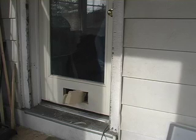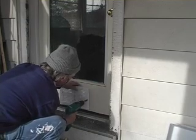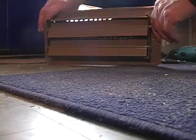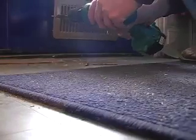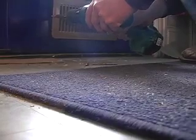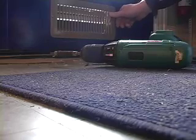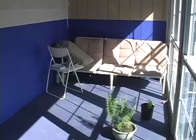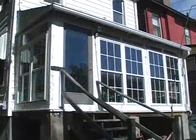That's a metal door with a styrofoam inlay. I'm putting a grill over it to make it look nice. So when the hot air is pulled out it's pulling air from the house — that's a vent that opens and closes. I open it on hot days but you could use one that just has a flap so you don't have to worry about it. On sunny winter days the porch heats up to 80 degrees, the thermostat switches on the fan and sucks the air from the porch into your house and sucks the air from the kitchen into the porch. We didn't put a lot of thermal mass in the porch because it takes a long time to heat up — unless you live there in the evenings you don't need it. You want the air to heat up so you can suck it in.